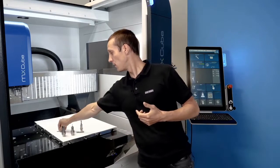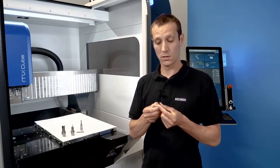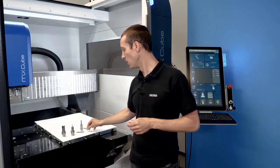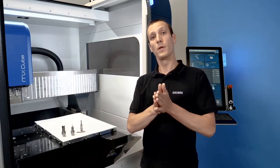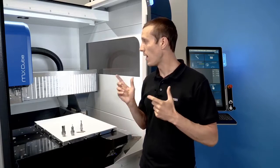We also have a radius tool as a single flute end mill — a ball nose basically. All kinds of tools between a diameter of 0.3 millimeters up to 10 or even 12 millimeters on the 8 kilowatt spindle. We can easily go down to less than a millimeter with the alcohol spray coolant and the high RPM of the machine.